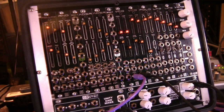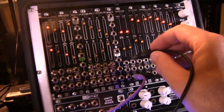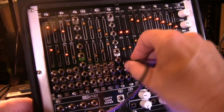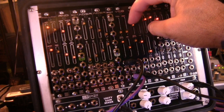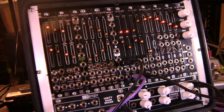The next slider is the modulation attenuator, and what that does is attenuate the amount of signal you put into the modulation input jack. For example, taking the sawtooth out of the VCO next to it and plugging that into the modulation input — as you turn that up your LED will increase in brightness, and as you lower your frequency down into LFO or slower rates you'll see it blink.